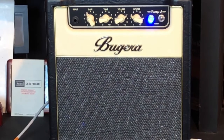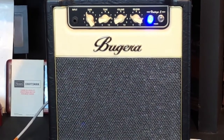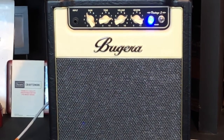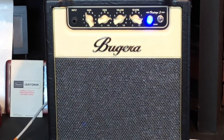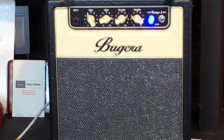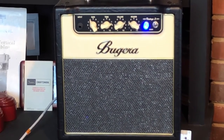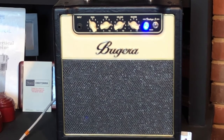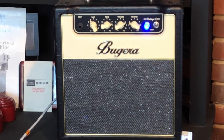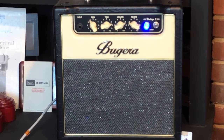So the traditional 12AX7, you get a traditional type output that, in my opinion, sounds great when you're driving 6L6s or 6V6s. If we switch to a 5751 preamp tube, we get a smoother, good sounding mid-range, nice lower end to it. With a 12AT7 preamp tube, again with a gain factor of 60, we get a lot more headroom before it starts breaking up. We get a cleaner, clearer tone and an overall chimier response to it.